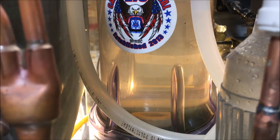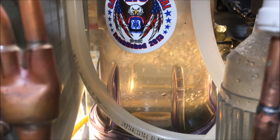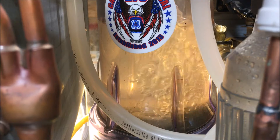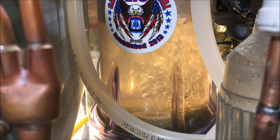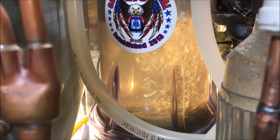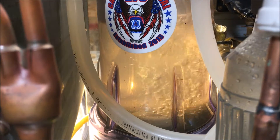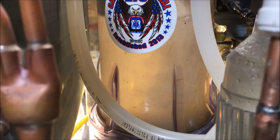Let's get on with it. I'm going to go ahead and start the experiment. First thing I'm going to do is turn on the pump — I said pumps plural because there's a quad discharge. I'm going to put them down to the level where I think the electrolyzer won't kick off. I'm going to start off slow on the electrolyzer so it's not going to kick off the pump triac. Cranking it up to about 200 — now we're at 500 watts.